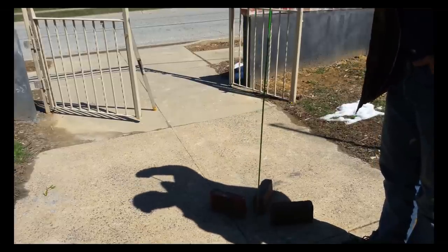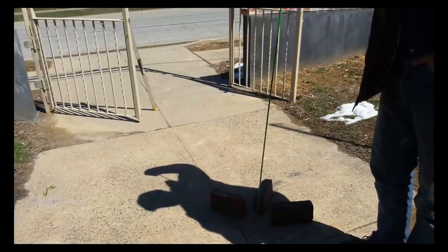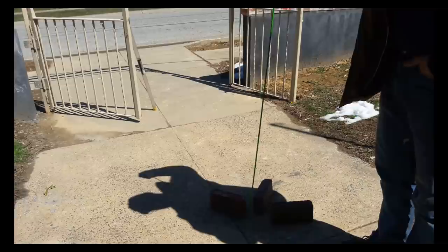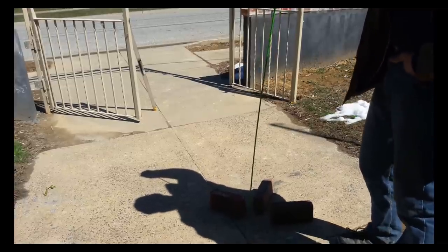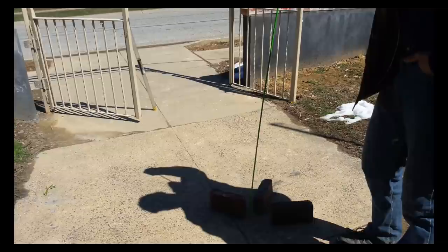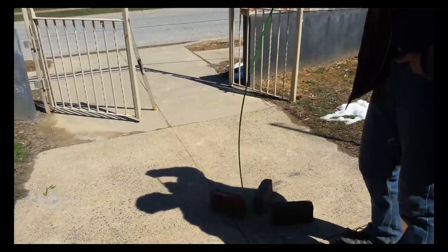Any leaning of it, any offset of it, will create the pressure to go towards that direction. Now this is encased in concrete, so it won't be as much as if it was towards the outside edge of the column pushing the pressure. When you start tensioning in the column, it's not going to compress. It's going to create a load inside this rebar that's going to want to flex out. It's going to want to blast out.